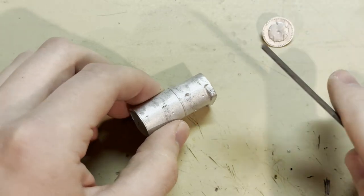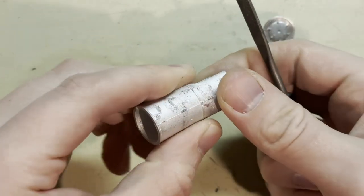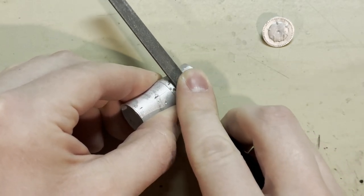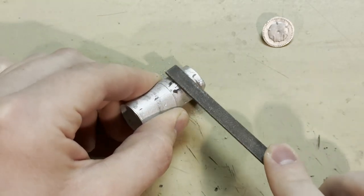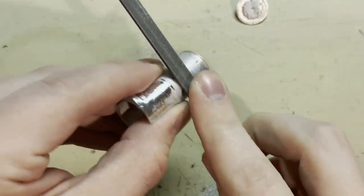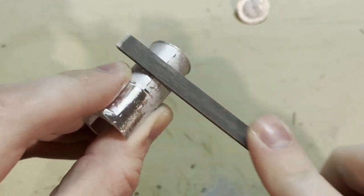So anyway, to start off, I need to take off this flash around the edges. It's not too bad so far. There's that seam on the side — just have to carefully file that away, make sure it stays nice and round. Cleanup's going pretty well so far. There's only a very small pit in that area which I'll fill in later. I'm using a sort of rolling motion with the file.